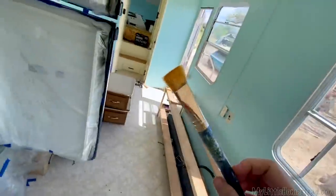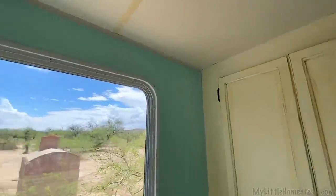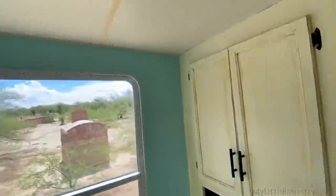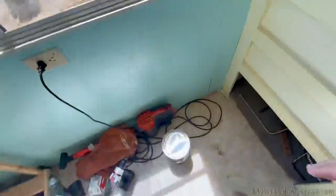I'm going to be cutting in with a brush — maybe a half inch to an inch — because I have to get this molding and I don't think I can do it accurately with a full-size brush. Cutting in is always the most time-consuming part of any paint project, and this molding makes it extra time-consuming. I have a smaller one too if this doesn't do the trick. It's brutal, but hopefully we only need one coat, though we may need a couple because it's discolored. It is satisfying because it looks much better when it's done — that's what keeps you going. We didn't go for ceiling paint because ceiling paint is flat, and I kind of like the semi-gloss that's up here — I think it'll be easier to dust and clean.